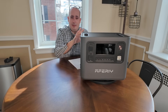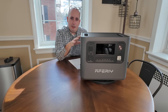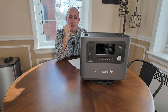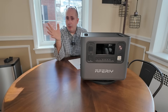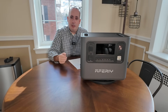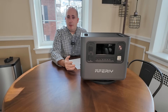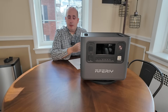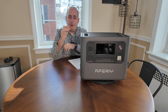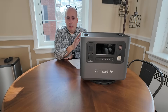A unit of this size takes you up from your typical 1,000 watt-hour battery. Once you reach the 2,000 watt-hour level, you can very comfortably plug in a couple of lights — in the living room, bedroom, kitchen, and hallway. That immediately prevents injuries because nobody trips in the dark. Then you plug in your fridge and comfortably run it for at least 24 hours. And for cooking, you can absolutely use this to power a microwave — which takes 1,000 to 1,500 watts — but you're just using it in bursts of a minute or two. This will have no problem powering a microwave.